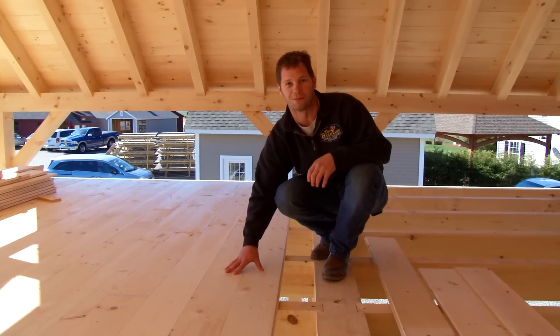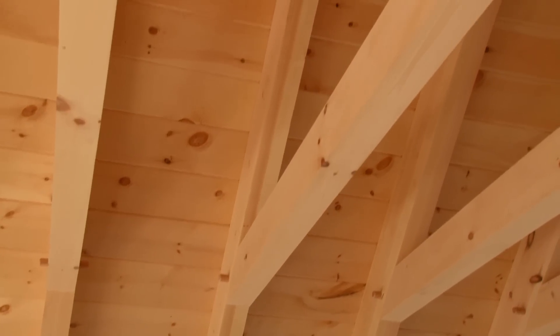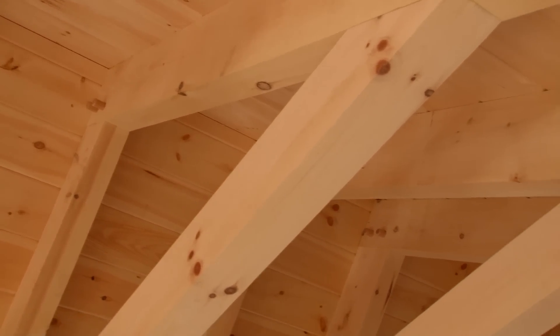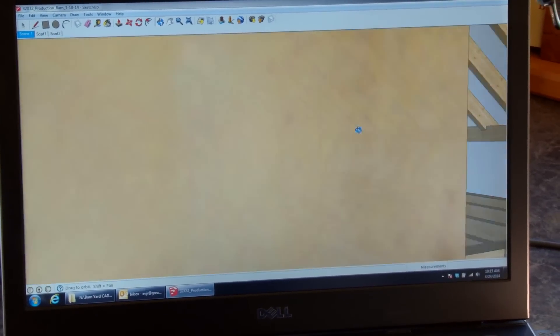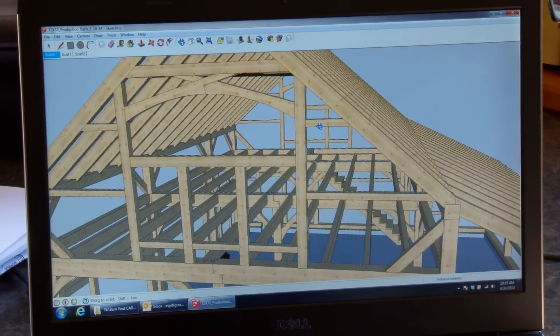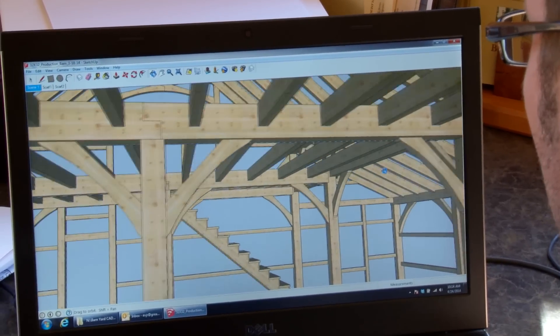With all of our timber frame barns, the timber frame does not stop at the wall plates. The roof rafters are also made out of 4x8 roof rafters, with everything in true mortise and tenon at the collar ties with oak pegs. Up top you can see a detail of what we call the tongue-and-fork rafter connection. One of the main benefits of our timber frame services is we do a full model — not only of the completed structure but also just of the frame itself — so you can actually see the frame, see the joinery, see the details, and know exactly what to expect.